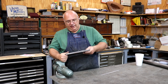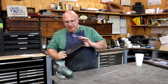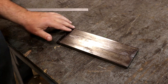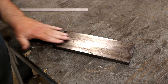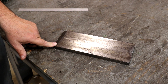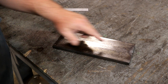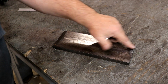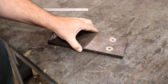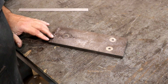That is the project today. I've got one little challenge we need to work on before we actually start grinding this face. So this is the platen we're talking about — he wants this surface ground flat. There's kind of a crown in the center; we'll know better when we get over to the grinder. But you can tell by looking at this, this piece has been exposed to the weather. There's a lot of pitting in areas right there, and on the back as well. Some moisture got to this at one point.